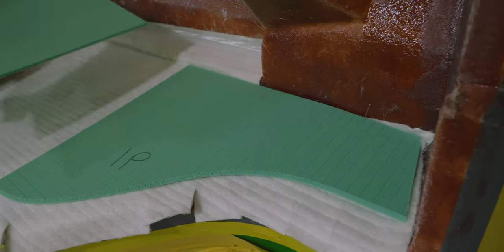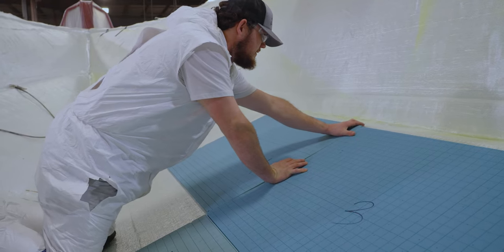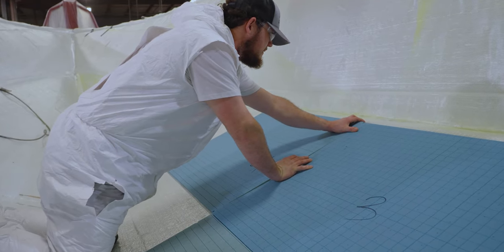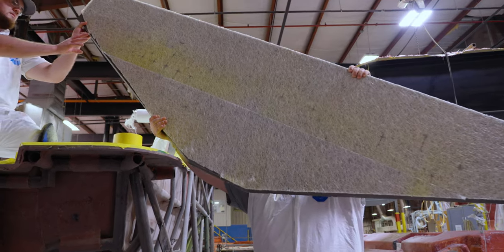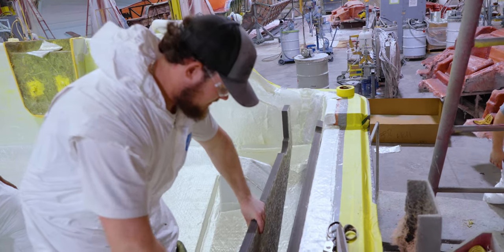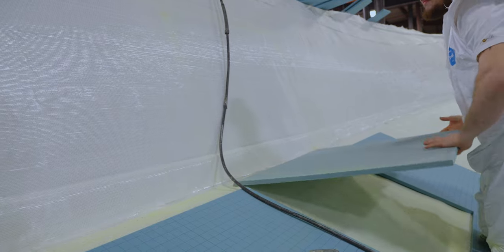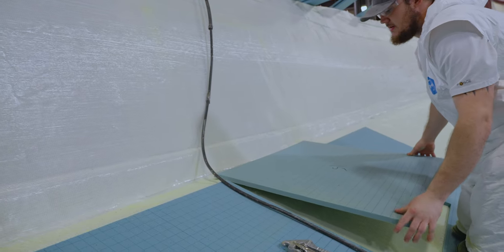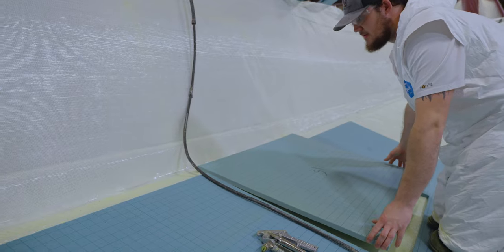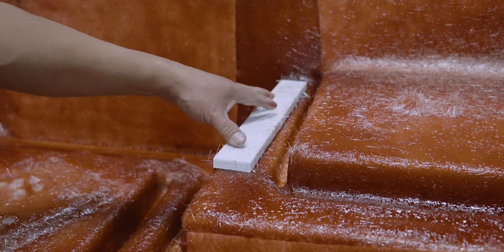While fiberglass is the primary building material for a modern boat, if you've been following the Behind the Glass series, then you're used to seeing the many other materials that get laminated into our boats. The use of highly engineered composite materials achieves two important things that wood would never be able to achieve. The first one is an obvious one. Composite materials never rot. It is a common misconception that encapsulation of wood protects it enough. The fact is that simply drilling or screwing into these materials breaks the encapsulation and can lead to premature failure.